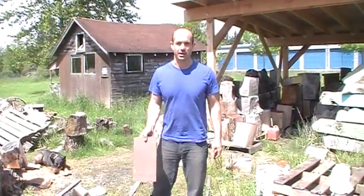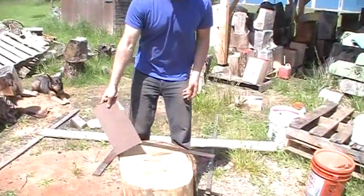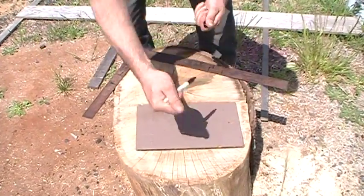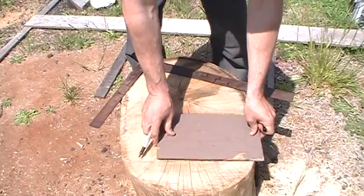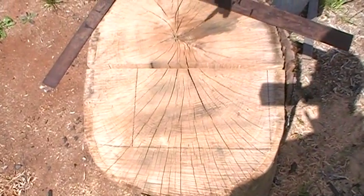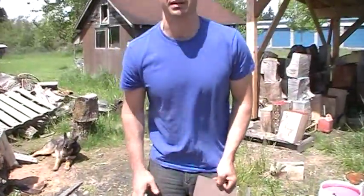It's a good example for the video of where we start. You have this board that's got marks on it and tells us how big the blocks need to be for cutting the helmet out of. This one's already been cut down the middle. What I'll do is come along and find a spot in the grain that I like and trace that out. This leaves me lines that I can cut with a chainsaw. I want to follow it straight down, so I put lines down in here too once these two pieces are split so I can follow it down and make a nice even block.